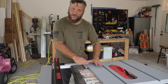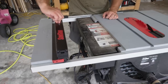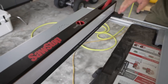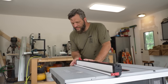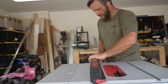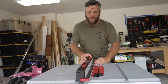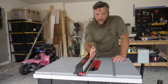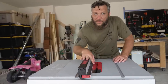Whenever you've got something like a piece of plywood shooting across here, there's nothing to support that. Wrong — you actually just flip this little knob on top of the fence and it gives you a little flat area to rest against. One of the other really cool features is that this extra little piece on the side actually detaches and you can attach it to the blade side so that when you're cutting something narrow, you don't have to get the full fence right up close to the blade and it gives you a little extra room for your push stick.